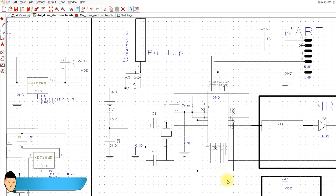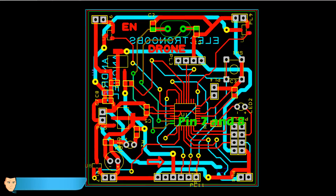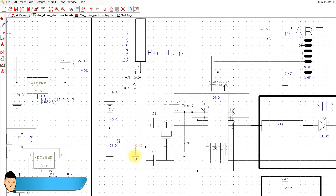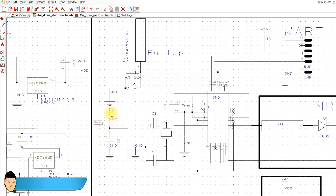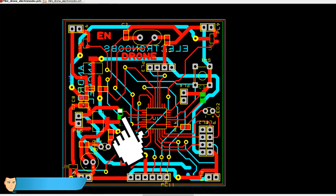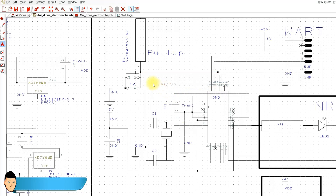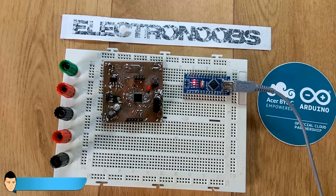We need a crystal oscillator of 16 MHz connected between pin 7 and pin 8 — you can see this oscillator in my design here. We also need two coupling capacitors connected between each of the two oscillator pins and ground. We need to power our chip with 5V directly to pins 4, 6, and 18, again with two coupling capacitors for stability. The reset pin needs a pull-up resistor of 1 kilo-ohm connected between the reset pin and 5V. Finally, we add a 0.1 microfarad capacitor between the AREF pin (pin 20) and ground.